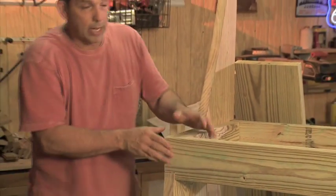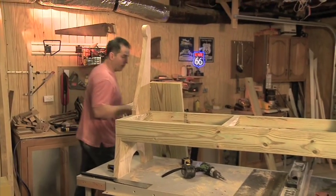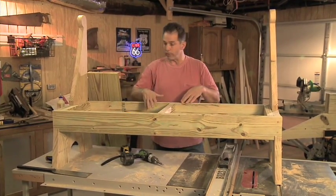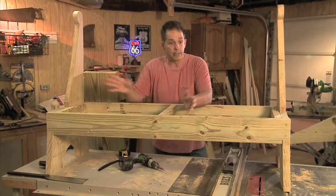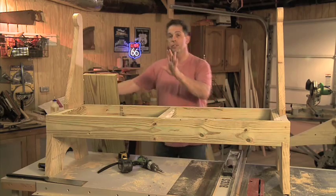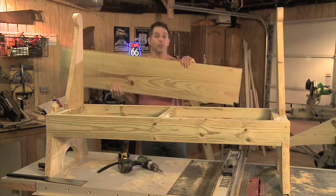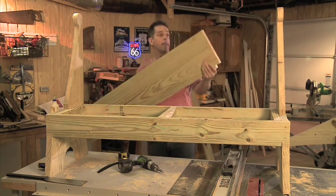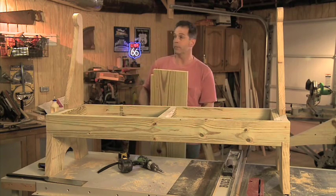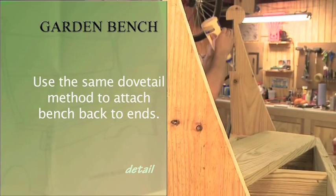Your piece should start to look something like this. In addition to cutting off those dowels, I've also installed a center brace between the two aprons — it just adds a little more stability. The next step is to put the back on. The back is just like the aprons except it's bigger and heavier — it's a two-by-twelve, the same length, and I've cut dovetails in each end. The next step is to put it up along the back, mark, and cut so we can put it into place.